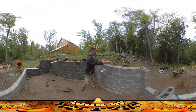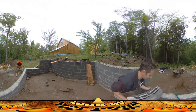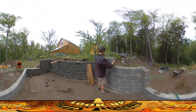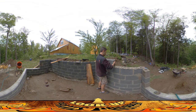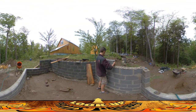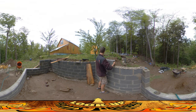So I'll put this corresponding brick in right here. Conditions today are really ideal — we just had rain last night, everything's nice and moist, and we don't have any really hard sun so it's easy to keep the mortar moist. Looking at the levels on top trying to keep it nice and straight. I probably put way more mortar here than I needed to, given that I'm trying to keep this nice and thin.